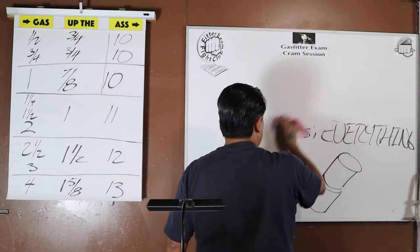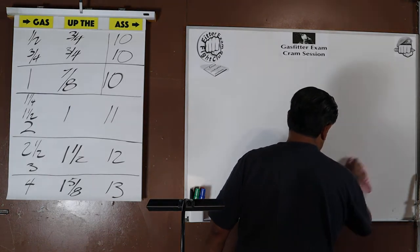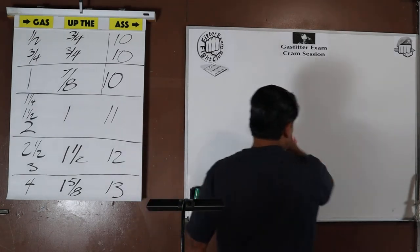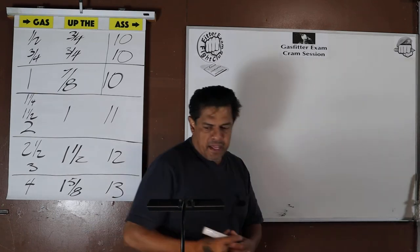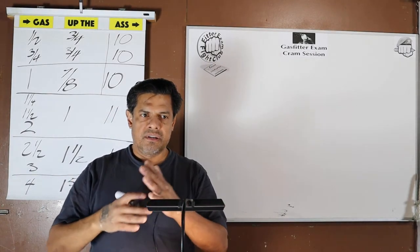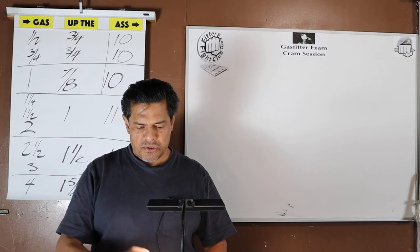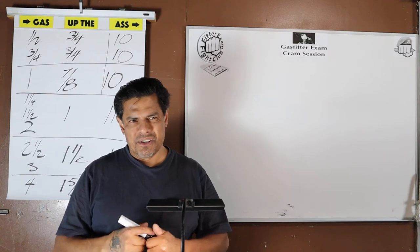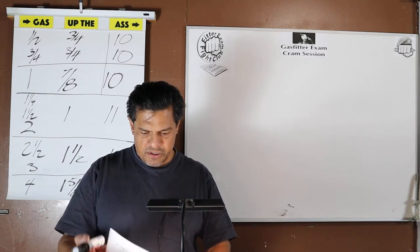Didn't really have a lot of welding questions in the practice questions, so when we hit the welding, we are going to spend some time on it because they do touch upon welding and sometimes they ask some weird questions. We'll go over all of that, but let's start getting this under our belt because you can have many different types of welds. You can join your metal depending on how you set up the joint, how you fill it. And here we're going to always assume we're just stick welding, okay? You can also TIG weld, but that's more for stainless steel. We're going to say stick welding. That's generally how you do it with steel piping.